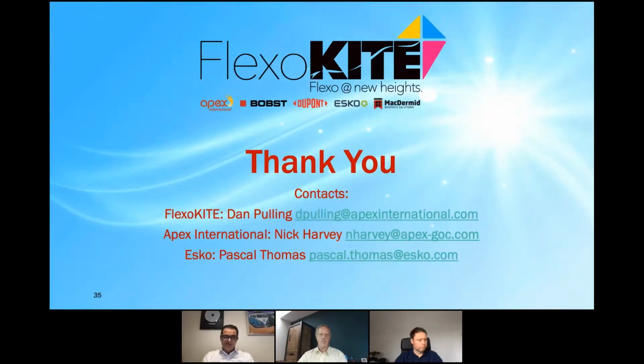But for me, from my experience, GTT specified for high speed, we have a solution. If you look at conventionals, again, you'll find that it is more apparent on the higher volume anilox rolls for 60 degree, even more apparent on some exotic cells like long cells, and it's all to do with that ink rivering up the back. And happy to take the discussion offline if that's necessary.